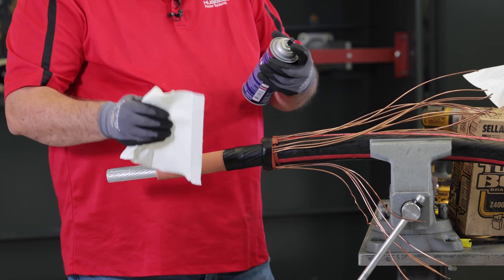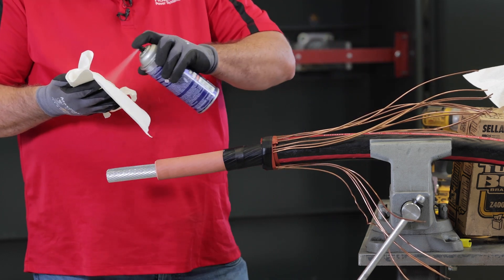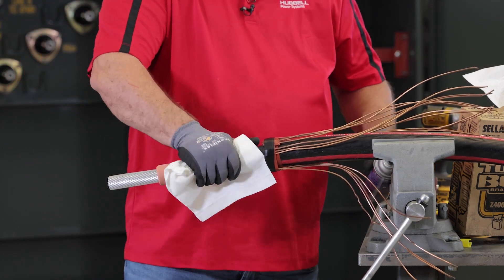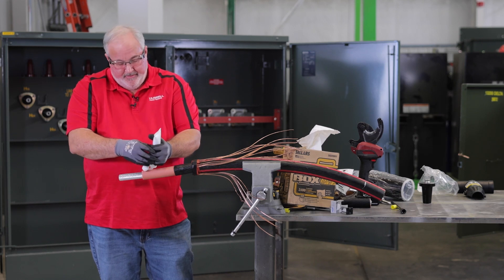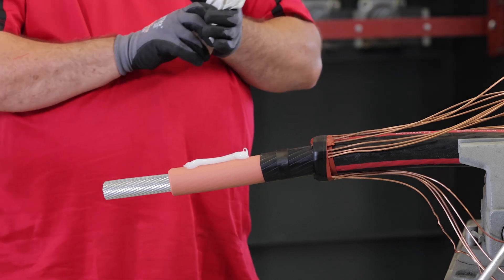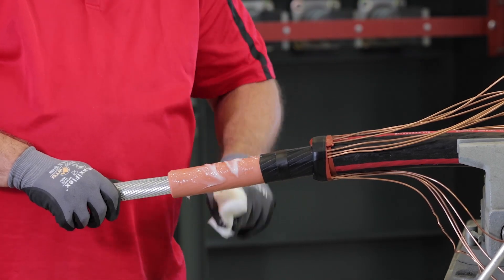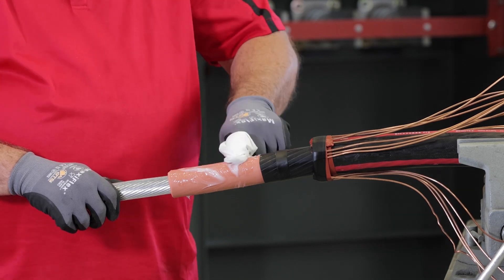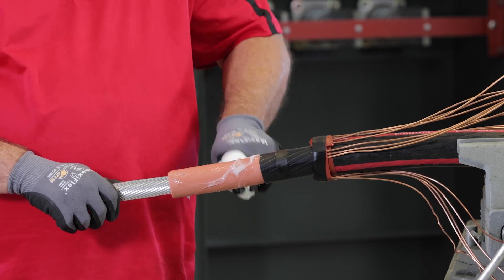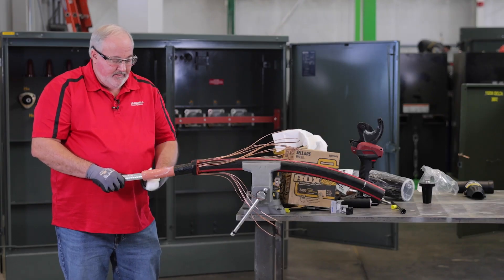Cleaning is key here, so we want to make sure that we're using the proper cable cleaner — it is designed for cleaning medium voltage cables. Clean this insulation really, really well. Then we want to apply silicone. Use plenty of silicone because you want to make sure that any imperfections in the insulation do not create an air void. You don't want any dry spots when you're putting silicone on the insulation — when you go to slide your cable adapter on, it's going to act like putting the brakes on, so ensure you use plenty of silicone.